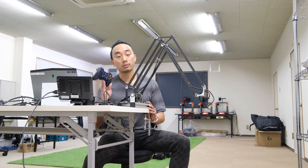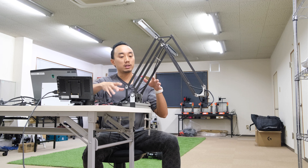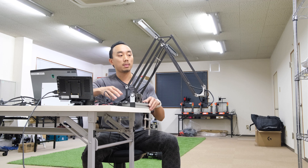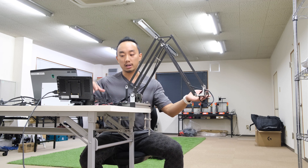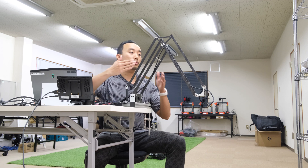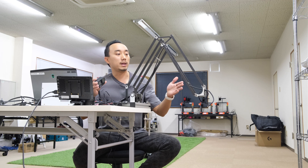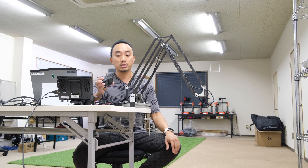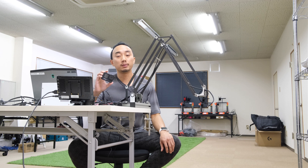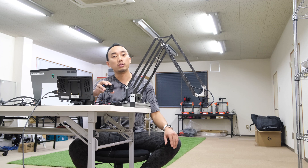From manual control via joystick, we can make sure we are able to control the robot as we want. If we attach this robot arm to the rover and drive around like an avatar robot, the operator might experience motion sickness or dizziness because the camera will be moving around. So I'm going to use the GoPro Hero 9 as the target camera for this application, because we can get a stabilized image from this camera. I can take advantage of this hardware and save time from developing image stabilization from scratch.